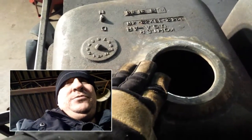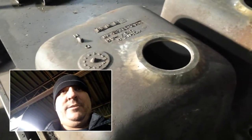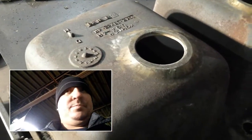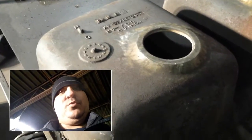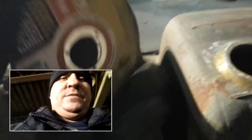I'm going to attempt to do this with ER 70-6 MIG wire, which is definitely not an ideal filler metal for cast iron, but I'm going to attempt it anyway. I've had some buddies that use that wire — just preheating, didn't bury anything — for various cast iron things that weren't structural, and they've had success. So I'm going to attempt it myself and see how it goes. I'm going to put you guys on time-lapse mode. I'm getting ready to use my Everlast Power Plasma 50.